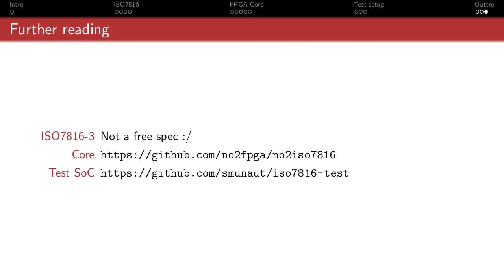One possible way out of it on the UP5K, that's something I've thought about, I haven't implemented, but that would be doable, is that the UP5K actually has DSP blocks, which are completely useless in this application. We don't need to compute multiplies and things like that. But there are 8 of those DSP hardware blocks inside the fabric, and the nice thing is that they include some 32-bit wide registers and 32-bit wide adders. And so you could actually implement both the configuration register to store whatever the timeout value is and the actual counter to compare to that value inside those DSP blocks, to basically implement the wait timer at a much lower cost in terms of logic. So far I haven't done that because this would be purely iCE40 specific, while the rest of the core at the moment is portable to any architecture without modifications.